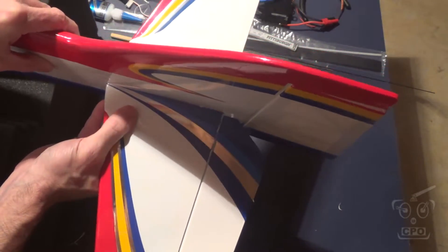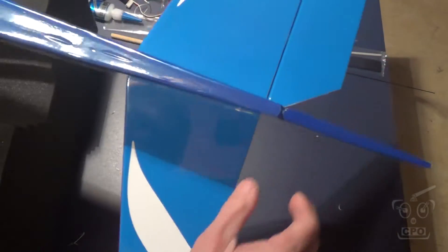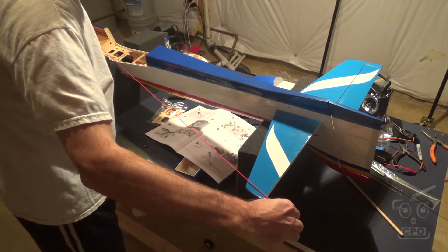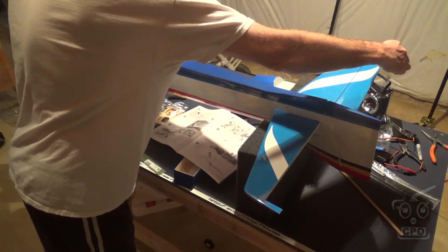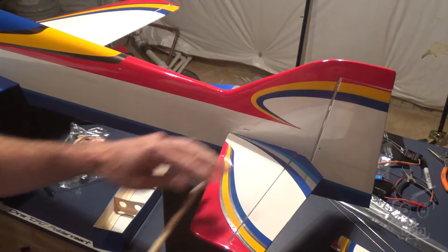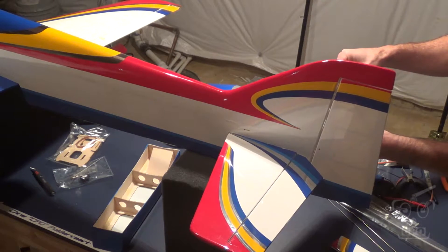The most important part of this is getting everything lined up. You want to make sure that everything is symmetrical from side to side, and I use a variety of measuring methods to do this. I generally like using a string — I've got some construction string that doesn't stretch at all. I'm using that just to check and make sure I'm getting the same distances between various points on the aircraft. I even came up with a little dowel and rubber band — this is actually a propeller band for a measuring device so I can get consistent measurements from side to side. Whatever method you prefer, just make sure that it is completely straight.